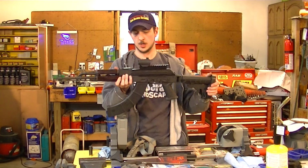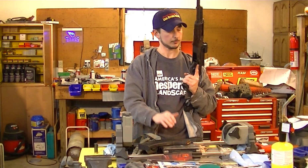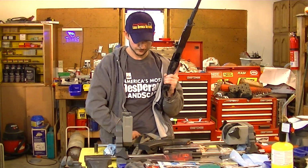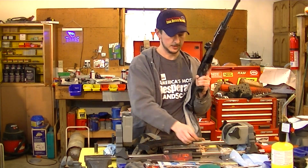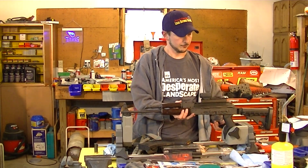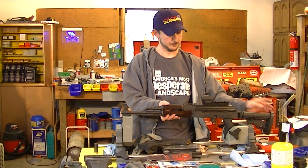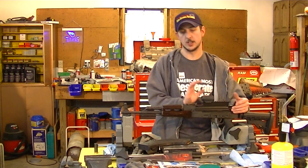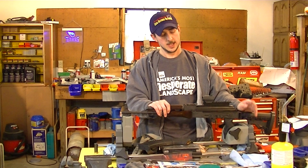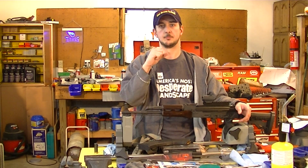Common problem on the AK-47 is you get trigger slap whenever rounds unloaded, done. Whenever you fire the gun, the bolt going over hammer, sear, trigger, whatever, your parts inside, make a long story short, it cycling back and forth causes that trigger to kick back, and it hurts your finger.